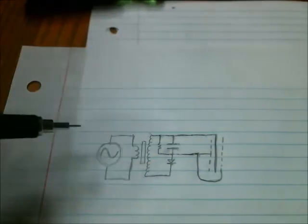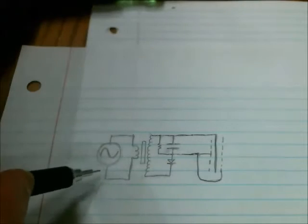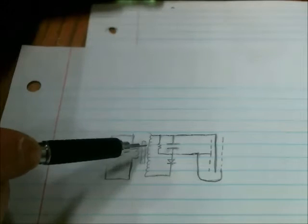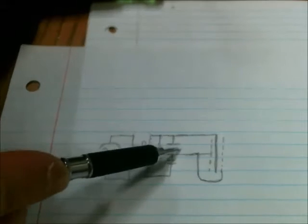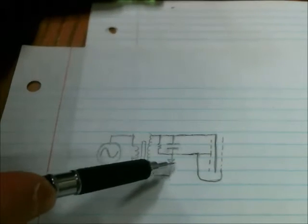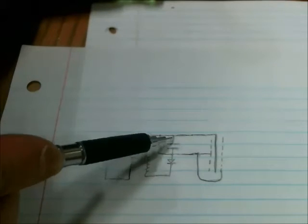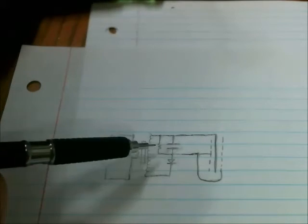Here's a rather simple illustration of the circuit within the racket. There's the oscillation of the inductor, resistor, transistor, and feedback which goes into the primary side of the transformer. That's stepped up so the voltage is much higher on the output, and then that voltage is stored in this capacitor here. It is rectified by the diode so it can only flow one way, and the voltage will store in here up to 780 volts DC.